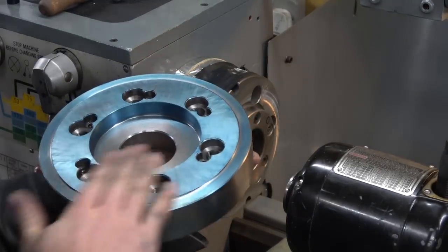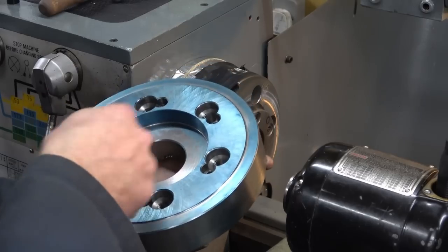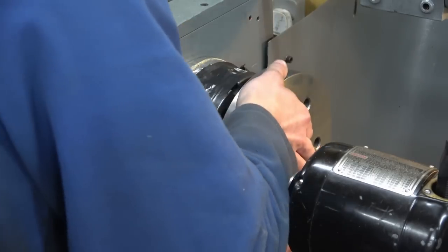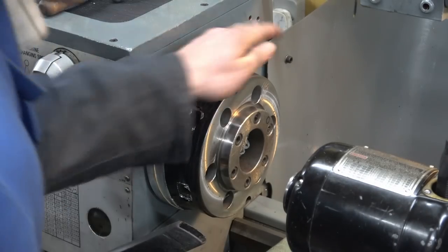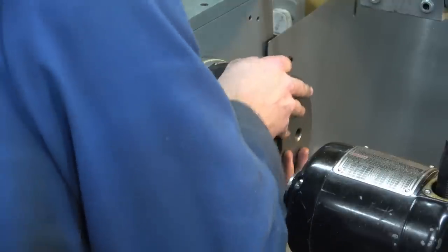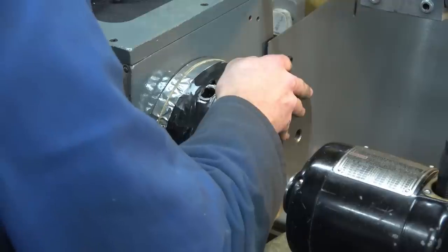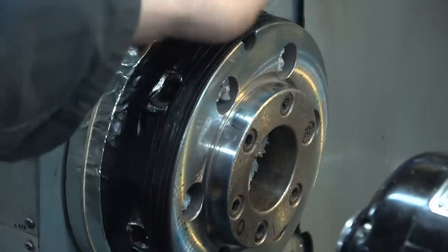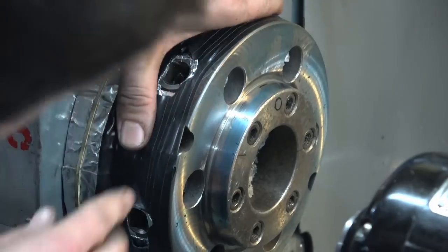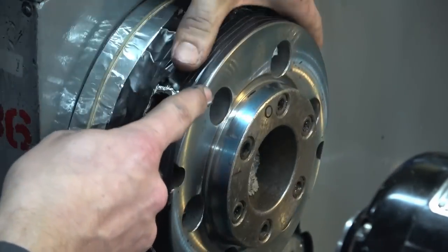Bluing round number two. Any patchiness on here I believe is just down to the consistency with which I've applied it using my applicator. Same principle again — back to my mark, bear down on 12 o'clock. At the top, good bluing, but that wasn't in question. There is now evidence of blue all the way around the diameter, albeit a bit heavier directly where I was pressing. There is also blue now around most of this face.